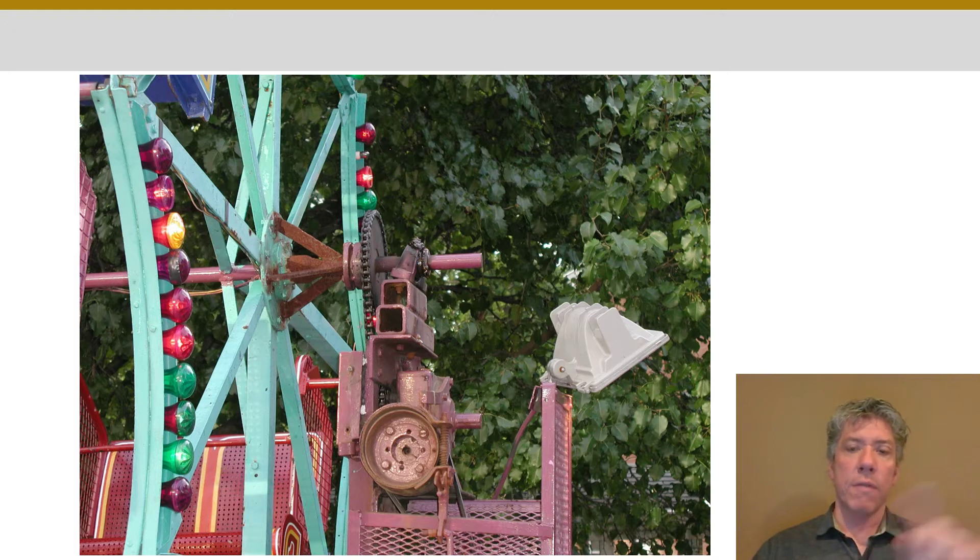You might also notice that there is a V-belt wrapped around behind that brake that apparently goes down to the motor. Notice they're using a belt system and a chain, but the gear reduction that occurs in the worm gear set would be fairly large. It's apparent from the shape of the belt and the chain that there's a speed reduction in both. The motor speed is much higher than what you'd want the machine to rotate, and it doesn't have enough torque to rotate it at high speed anyway. So the V-belt changes the ratio — increases the torque, decreases the speed a little bit — then the worm gear set increases reduction a lot more. And there's a chain used after that, which also appears to have a small reduction.